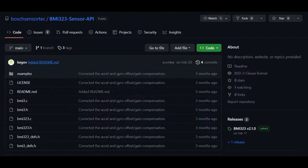There is a full datasheet with absolutely everything you need to read every register and set every filter. However, if you just want to get right in there and have this work with your microcontroller or microcomputer, there is a published C API. This doesn't have any binary blob, so you can port it to whatever platform you like. Inside the examples folder is a common.c and common.h, and that's where you would put in your SPI, I2C, or I3C read, write, and delay functions for whatever protocol you're using. You implement that and the rest of it comes out — you can then grab the accelerometer and gyroscope data, feed it into your own sensor fusion, or just use the raw data.